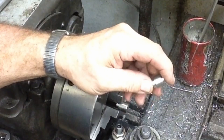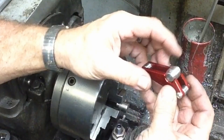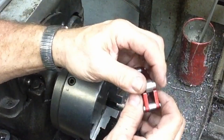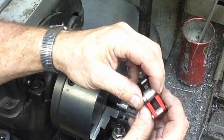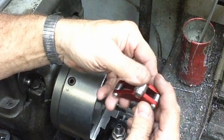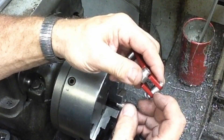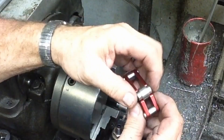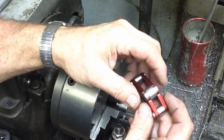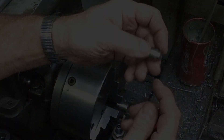These are our little pivot pins that hold our bolts going through in the top just like that. What I'm doing is just rough turning. Even though they're all supposed to be exactly the same, I'm going to do a final fit on these to each individual pocket. The difference is going to be any spacing variations we have, because we want it to have a nice free movement down in there. Anyway, I'm facing them off and doing this all just with a parting tool.